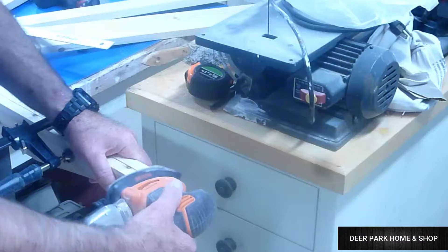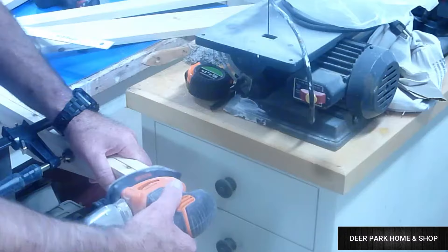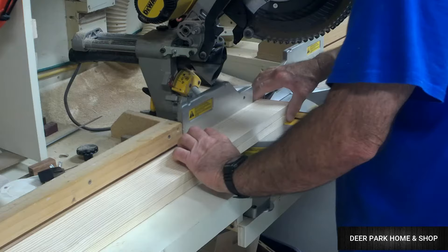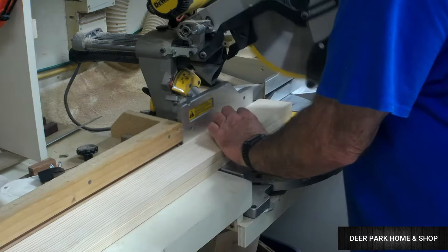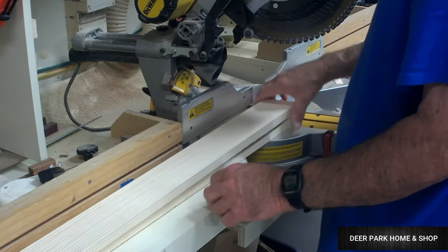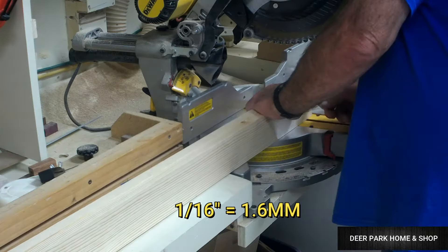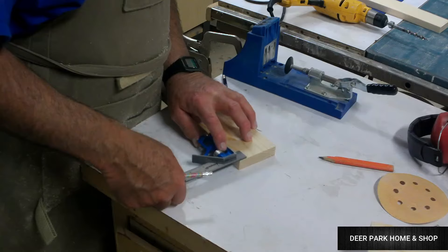I clamped the sides back together again and sanded my angles. While the boards are together you can round over your ends. When this is done, go ahead and cut your bottom angle. I sandwiched my sides back together with the top end square and flush, then trimmed both bottoms at the same time — cutting all the way through side B and taking about a sixteenth of an inch off the already-trimmed bottom of side A. What I ended up with was identical boards with identical angles. We'll set these aside for now.